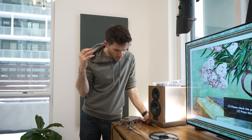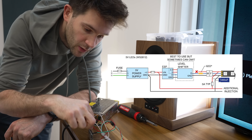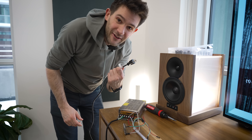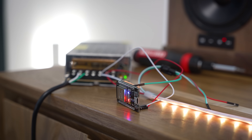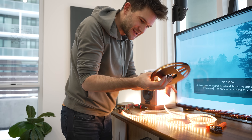This should all be wired up and ready to go now. My white wires are my grounds — they come off of the power supply and go both to the controller and directly to the LED strip. This green wire comes off the LED strip and goes to the board — that's the data that controls everything. And then we have our positive red wire, with one wire going to the LED strip and one wire going to the board. And hey, it works! But you definitely don't want to have all of your LEDs coiled up together when they turn on, because they could overheat and potentially kill themselves. So let's uncoil this so that heat can dissipate a little bit easier.